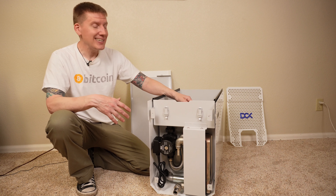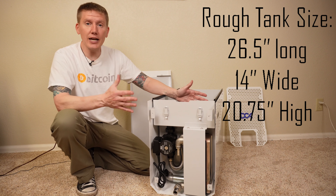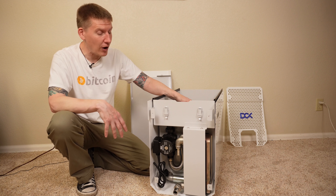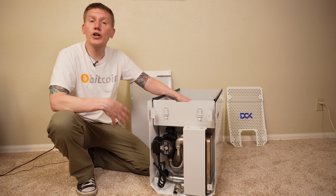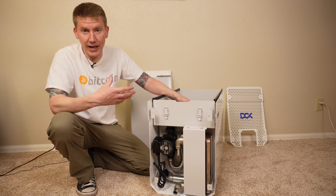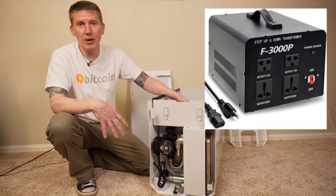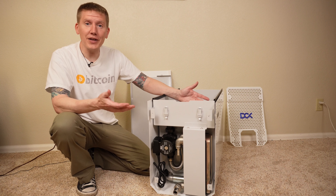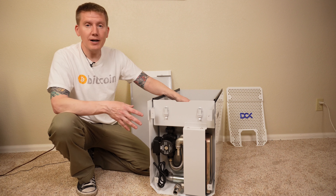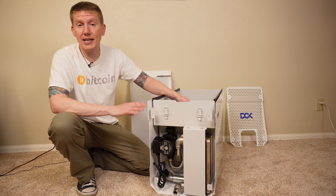The last thing I really like about this setup is its compactness. It's a very small system — just enough room for a pump, a heat exchanger, and two miners with no real wasted space. Now, all systems do have downsides. For this system, you have to know the pump is wired for European power — 240 volts single phase. If you're going to run this in the U.S., you can't just plug it in the wall; you'll need to buy a power adapter, about $100. Also, this is a very simple system — you plug it in and it runs. It's not really made to run with a control system, though I'll show how I tweak it for mine.